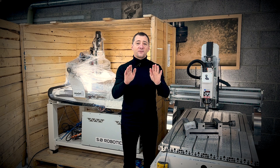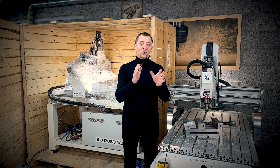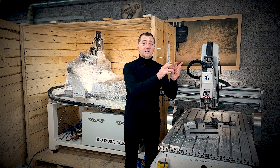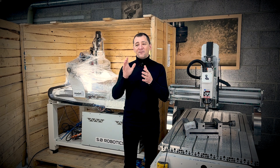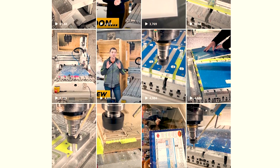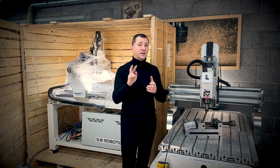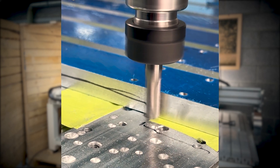I'm sorry for the interruption — it's only after reviewing the footage that I realized there are a couple of important things I didn't talk about. First, speeds and feeds: I didn't mention them because I didn't want to stand here and say you can feed an 8mm tool 3mm deep at 5,000 mm/min at 16,000 RPM. I have a lot of footage on the Tony CNC Instagram page where I actually do list those parameters. It's a personal thing, and you can also follow the manufacturer's recommendations.